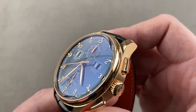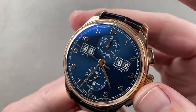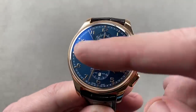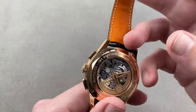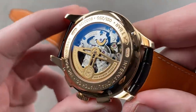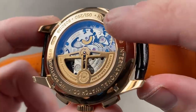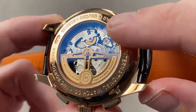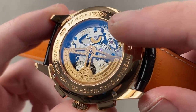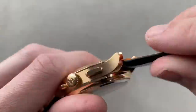It features a mono-counter at 12 o'clock — two superimposed hands, one with a 60-minute format for the chronograph and, underneath that, an hours hand — allowing the watch to have a wonderful cruciform symmetry. You can split it two ways and keep the dial symmetrical. Turning it over: caliber 89801, 68-hour power reserve, flyback chrono, perpetual calendar, hacking seconds, quick-set, free-sprung, 28.8 beat rate, IWC Kurt Klaus perpetual calendar system. And the Albert Pellaton pawl-based winding system — this version of the Pellaton is a four-pawl system more efficient than the two-pawl system. This is a manufacturer movement made by IWC, and unlike most limited edition IWC watches, this one is individually numbered out of its series of 250.